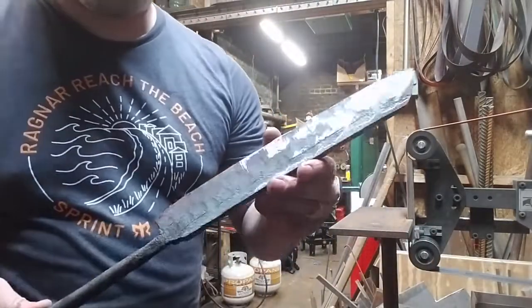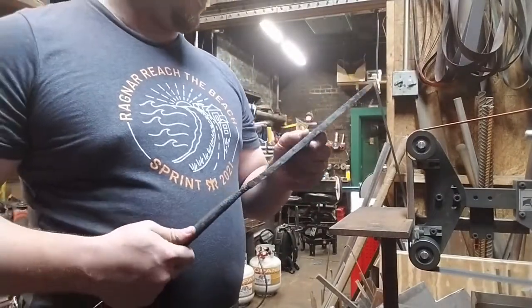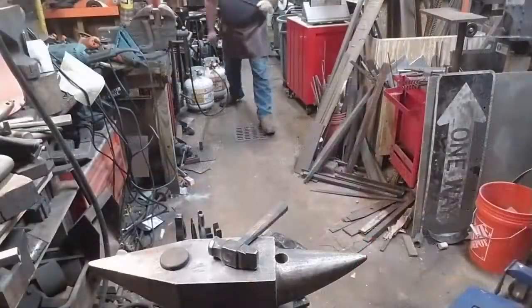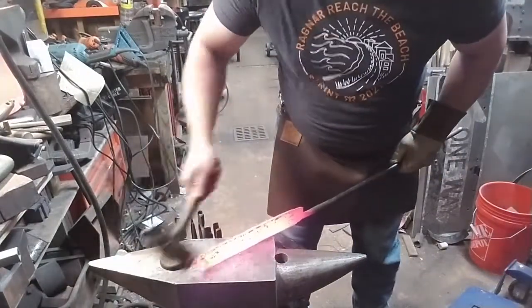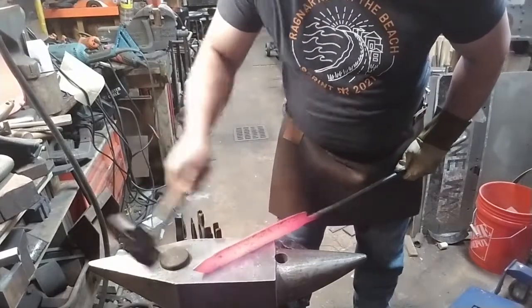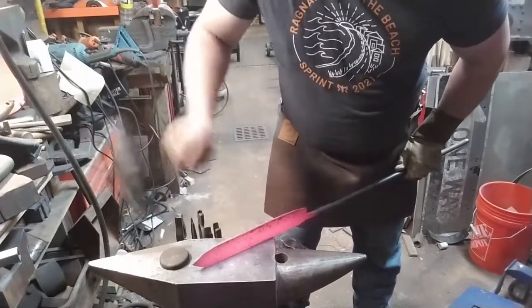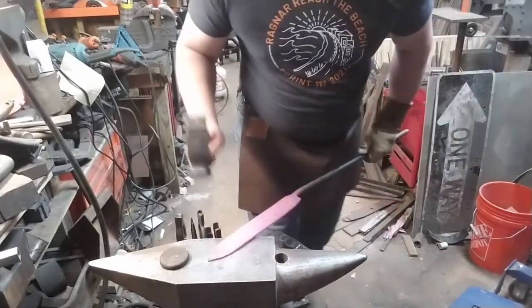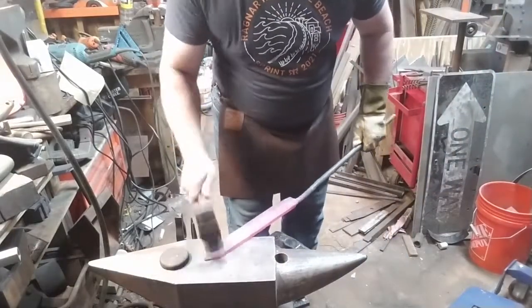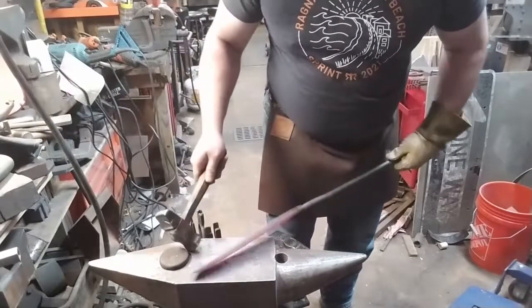Here we're rolling over the end of the knife and turning the bottom of the knife into the center of the knife. And that way the pattern on the blade will flow much more fluidly. We do see that in Norse construction, seaxes, in drop point knives, drop point and clip point seaxes.